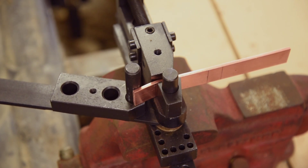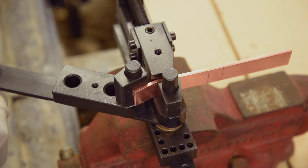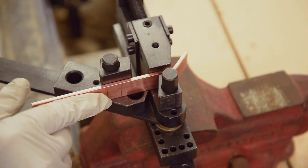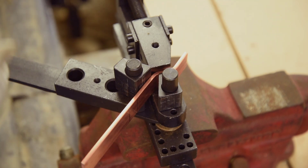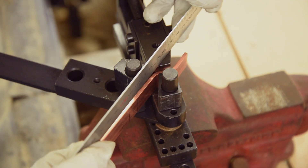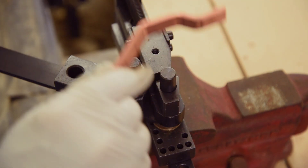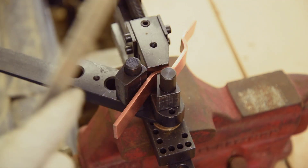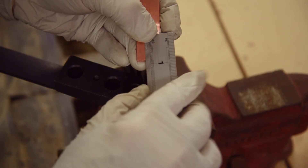Not bad, though. Let's try to do the copper bus bars. The copper I'm using is 1/8 inch thick and 3/4 inch wide, and the bars are a little over 5 and 1/2 inches long. It's taking a good bit of pressure to get it to bend — not as much as the 1/8 by 1/2 inch steel, but close. I need to bend an offset in them to clear another 3/4 inch wide copper bar, so I'm going for a 1 and 1/2 inch offset length at the bottom. Here is where, if the movable jaw had a narrower width, I could have had a shallower offset. I tried using the smaller pins to do an offset and it did make for an offset a little over a quarter of an inch, but with the rounded pins it just rounded the bar too much and I have to have flat ends. So I'll live with the deeper offset for now.